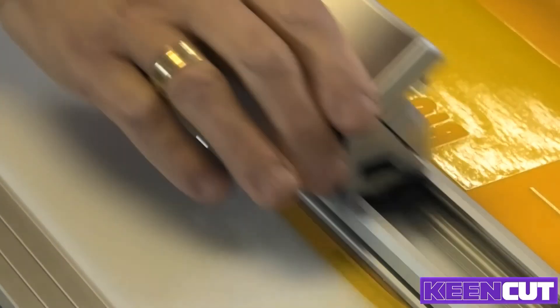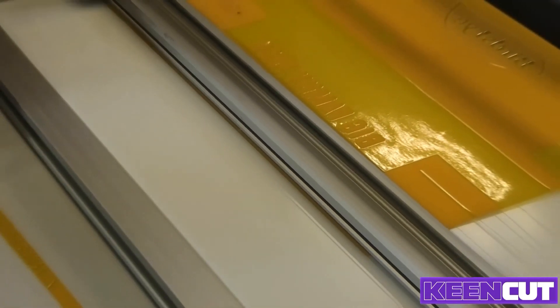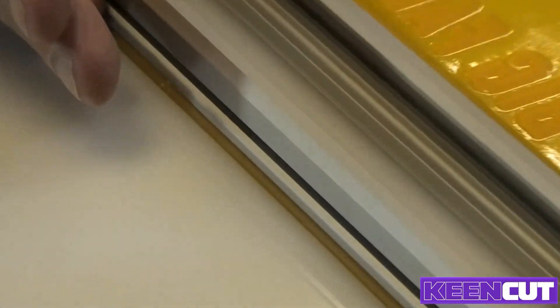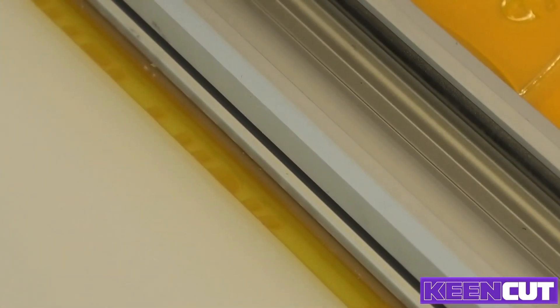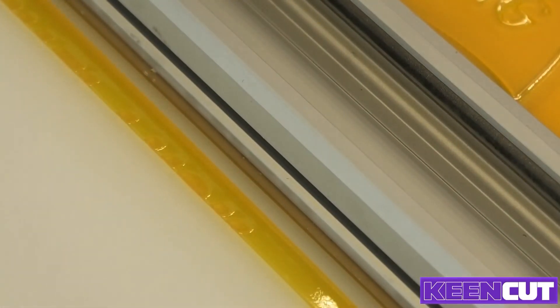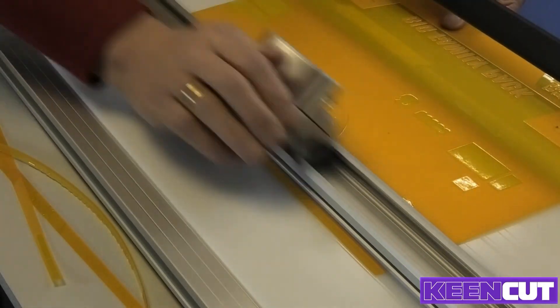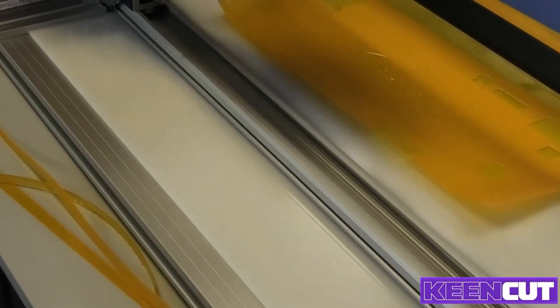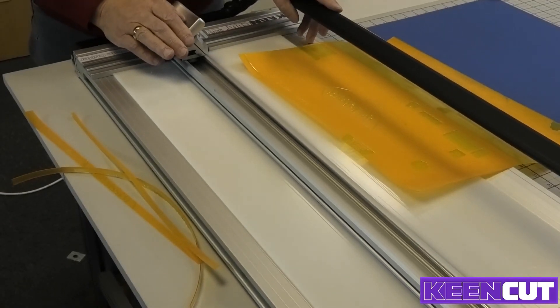Again, use light strokes. You'll find that it will cut exactly on the sight line strip with a five-degree undercut, so that when you turn your plate around to cut the other side, follow the same process: take most of the waste off, move up to your proper position. Then when you mount onto the roller, you should have no gaps.